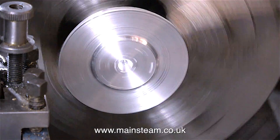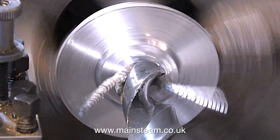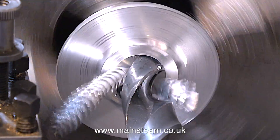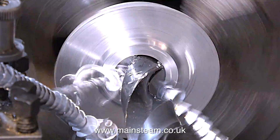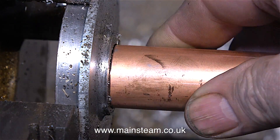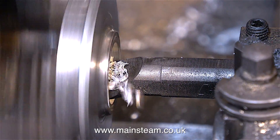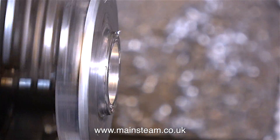Time now to first of all centre drill the piece of aluminium, and drill through it a couple of drill sizes below one inch. That is because if I drilled the hole all the way through using a one inch drill, apart from the fact that the tube would be a bit of a rattle fit, it would fall all the way through into the condenser. I'm now using a boring tool part of the way through the aluminium to make it the correct size to be a snug fit for the chimney tube. That's not the lathe wobbling by the way - I've just kicked the tripod, as it's very close to where I'm working.